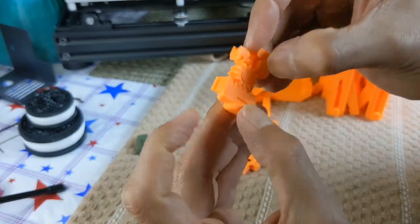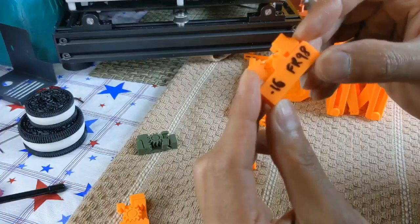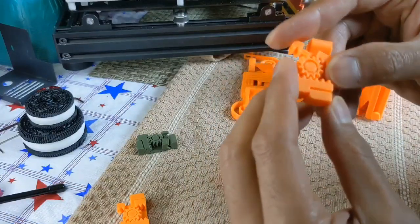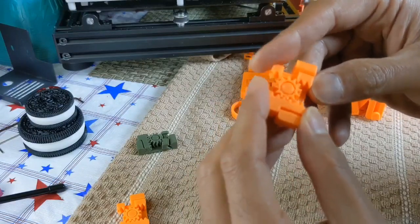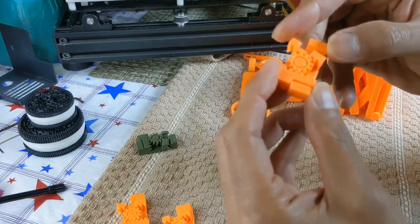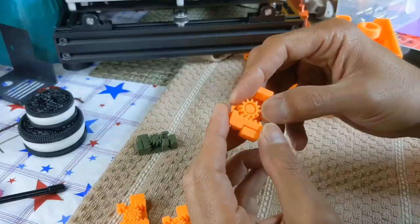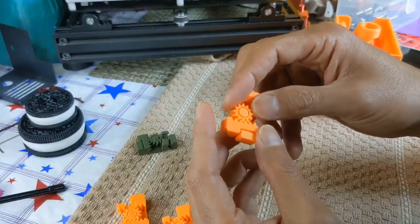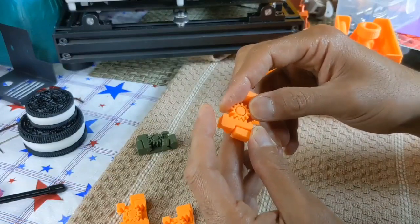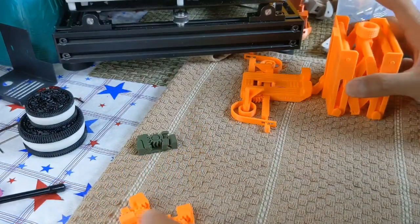Just to give you an idea, those little changes can make a big difference. I tried 0.16mm at 98% flow rate and that came off really really loose. Then I did another one at 0.16mm and 100% feed rate — that one also came a little loose, but that's fine, it's just a test piece. The whole point is to see if the gears can move and print freely instead of getting welded together, because that's going to be a waste of 17 hours.